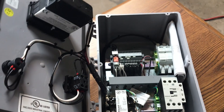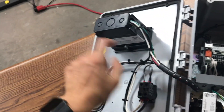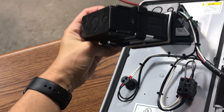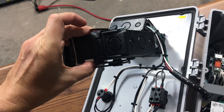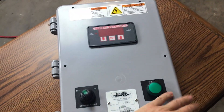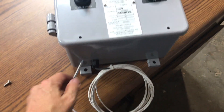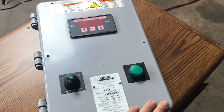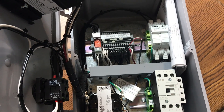Here are the internals of the combination control. You can see where the T-DE20 comes through — they have a hole punched through here on the side. When you get a new DE20, it does not have that hole, so you can reuse this shell or punch through the back knockouts however you see fit. You can also see where the RTD 1000 is coming out the bottom and how you'd replace it. The newer combination controls have a different latch and a different mechanism on how they are mounted internally.